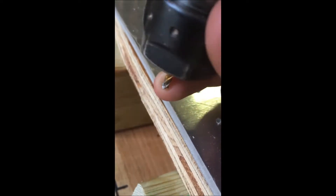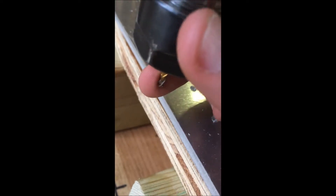Yeah, so you can kind of see how it looked like the aluminum just melted onto this end mill. It should come right off — I don't think the carbide or the coating were damaged. I'm just going to turn it around for now, because it's double-sided.